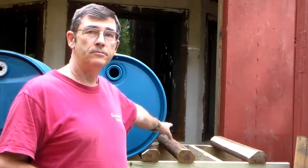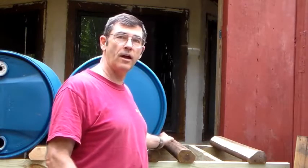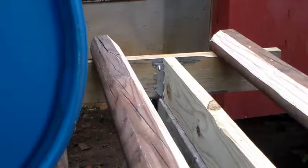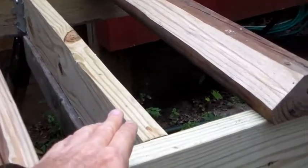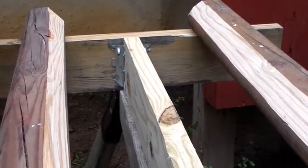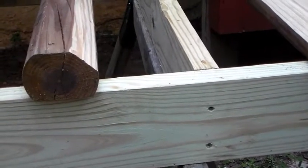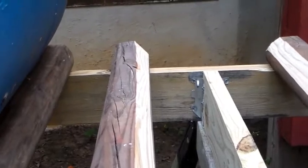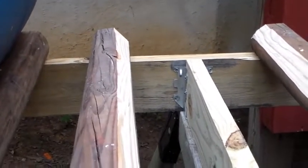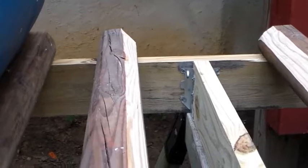2x6s are on the bottom. These landscaping timbers hold them so they don't rock back and forth, and they also supply a little support to the sides of the barrel, with a 2x6 underneath. Structurally, you've got a frame and the member that's underneath the barrel. As you can see in the back, it's been put in with a joist hanger, and I also put two screws in from the end — that's about as solid a connection as you can make. Joist hangers are very simple to use and tremendously strong. They'll make this thing carry its maximum weight.